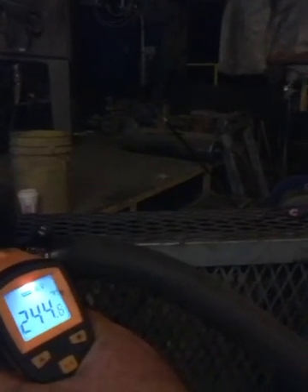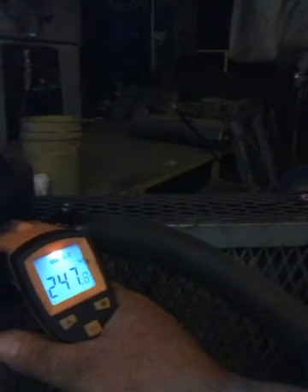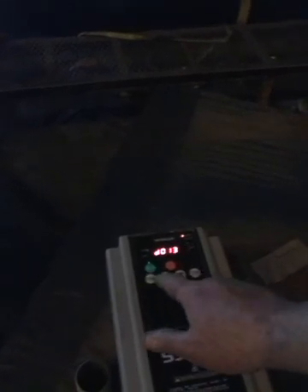Now at 245 degrees outlet. Press charge is 125. Electrical readings: 15.9 amps, 192 volts — that's 3.8 kilowatts worth of usage. Later we'll show you what we're getting out of the turbine.